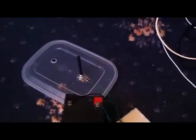Okay, so here's a quick view of the circuit in action. Right now the potentiometer over here is turned up to full resistance, which means there's hardly any current getting to this transistor here. So there's hardly any current getting to the bulb, and certainly not enough to light it up. If I turn the potentiometer down, thereby decreasing its resistance, it should allow more current to get to the bulb, and the bulb starts to get brighter. And if I decrease the resistance fully, then the bulb gets maximum current and is fully bright. If I turn the potentiometer resistance up, the bulb gets dimmer and dimmer until the resistance is so high that there's not enough current to light the filament.